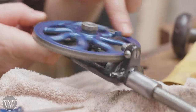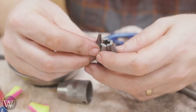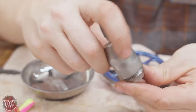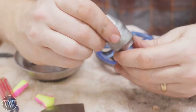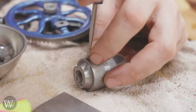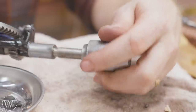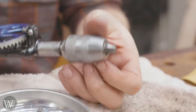One of the reasons I like to shoot videos when I'm redoing things is it lets me see — oh, that screw goes there, not there — you can go back and check it. This little piece had the adjustment so you can move it closer to the large gear. For the chuck, you put in all three of the jaws into the main body and then thread on the outside sleeve, running it until that set screw lines up with the hole inside, then put the set screw back in — and that's the chuck. It's a very simple design and works incredibly well. That then threads onto the main shaft with just a little bit of oil, and there you go — the functioning chuck.